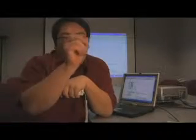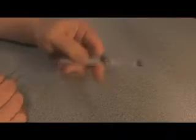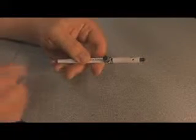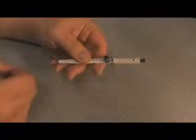Now, this camera is sensitive only to sources of infrared light, which is why it can track things like the Nintendo sensor bar, light bulbs, or candles. So if we want to track pens on an electronic whiteboard, all we have to do is create pens that emit infrared light. The light pen is composed of an infrared LED, a push button switch, and a connection to a power supply, which could easily be a battery.